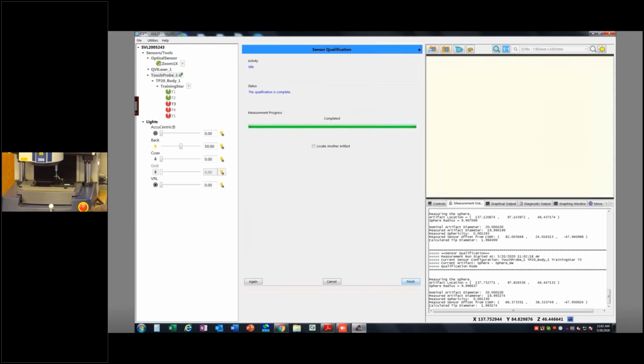Yeah, you can use a star with a standard module, but you can't do the pull hits with any accuracy. So if you want to pull upward, you're not going to have a whole lot of luck. And then what speed do you use? There are default speeds built into the software that QVI recommends based on these controllers. Those can be adjusted. I'll show you when we create a step. You can adjust them a little bit, but in order to get the accuracy out of them, you don't want to start playing with those too much.